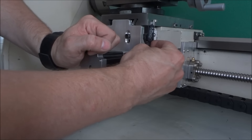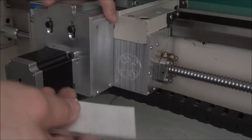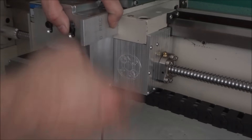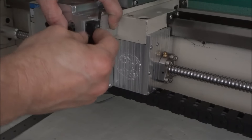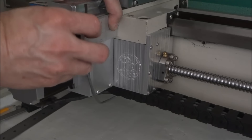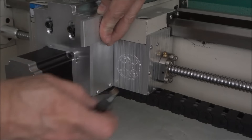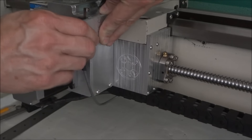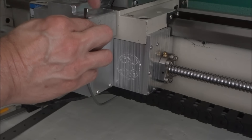I'm going to try to figure out some mounts. What I thought I'd do is take a scrap piece here and use the two holes that are already there, then mount a bracket like so and mount my switch to the bracket in this fashion. I could even put it on the inside — yeah, I will put it on the inside — and mount the switch here like so. When the X comes back it'll trip it.